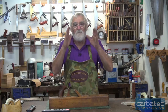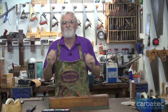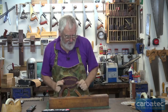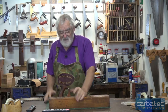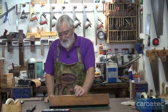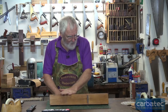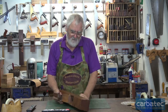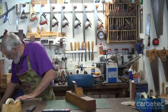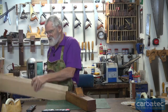When you join a board, it's basically getting two boards and shooting them so they're flat, so when you join them together they're going to line up, be square, and you can get a good glue joint. Now this is nearly 150 to 160 years old, and I bought that for $40 and spent a bit of time doing it up. It is as good as the day it was made — actually better, because it's got a sharper blade on it.